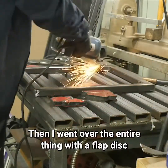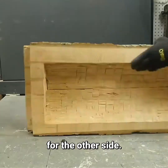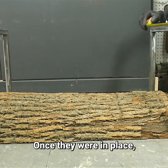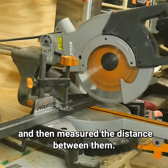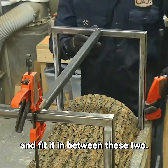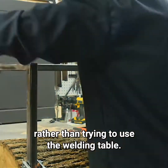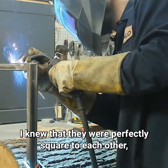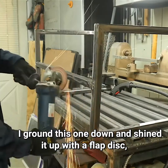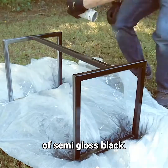I like frames like this to be flush on the outside, so I took a flap disc to each one of these welds to get them completely flat. On the inside corners I wasn't quite as worried, but I used a file to wear them down a little bit. Then I went over the entire thing with the flap disc lightly just to remove the mill scale. I made another frame the exact same way for the other side, then flipped over the log and fit these pieces into the gaps I had cut. I measured and marked the center of each frame, measured the distance between them, cut a piece of square tubing with a flat end, and fit it in between the two. It was easier to hold them in place with clamps and tack them before doing full welds. I ground this one down and shined it up with the flap disc, then took it outside and added a couple of light coats of semi-gloss black.